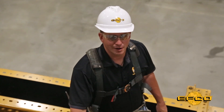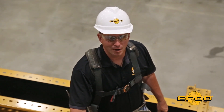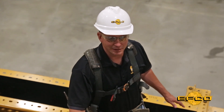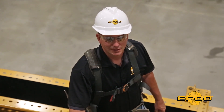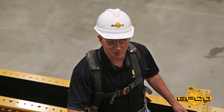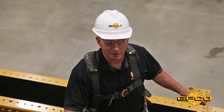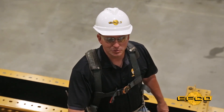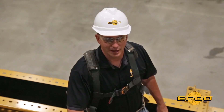I'm Matt Harrington and today's Toolbox Talk revolves around the most common problem folks have with setting EFCO walls: the setting of the top yokes. Top yokes come in TY2, 3, 4, and 7. That designation just describes how long the top yokes are depending on the thickness of the wall. The top yokes are used to take the place of a top tie.